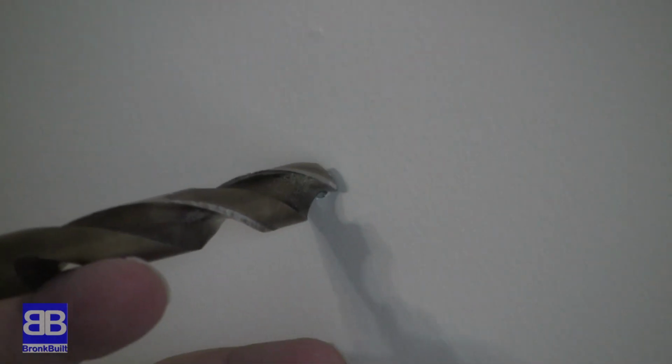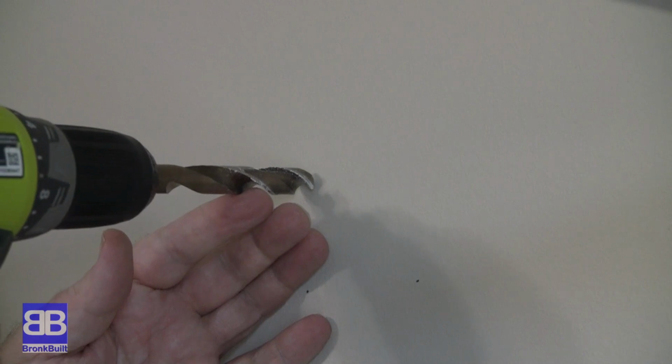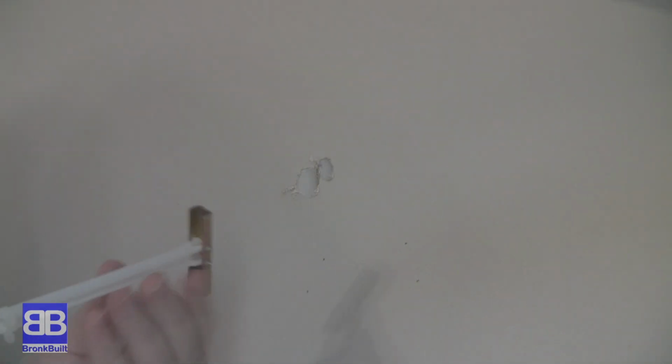You just watch me use the mounting holes as a template to drill the initial holes into the wall. That way, I'm sure they'll line up perfectly. Next, I use a 1/2 inch bit to make those holes big enough for the drywall anchors to slip inside.